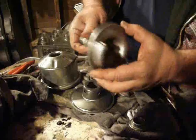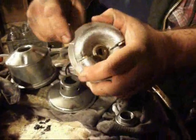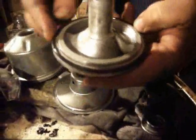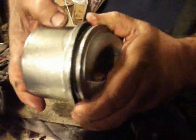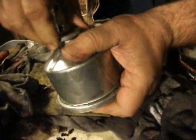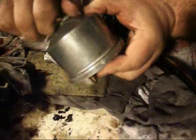Okay, we've got the bottom of the centrifuge unit. There's an alignment mark. We're going to put the O-ring on. Got a little separation disc here. And then we've also got an alignment mark on the cup for it. We're going to line these two marks up. Alright, squeeze it together. We've got a nut that tightens it up. I'll tell you why there's an alignment on this thing in just a second. I'm going to tighten it up.